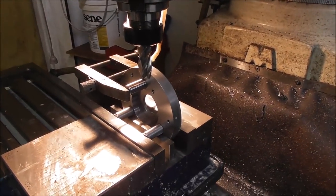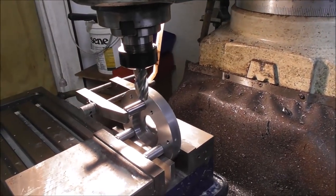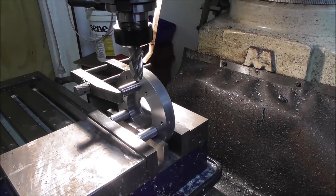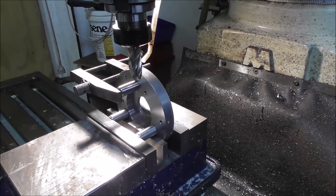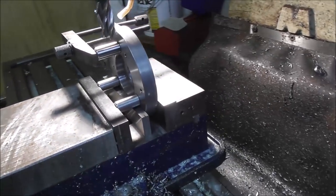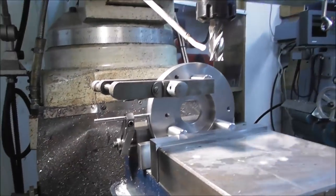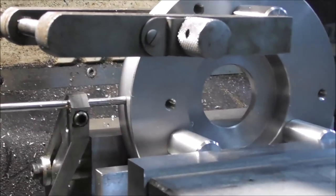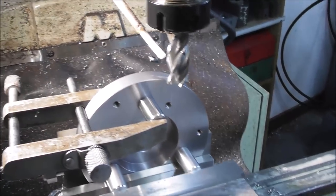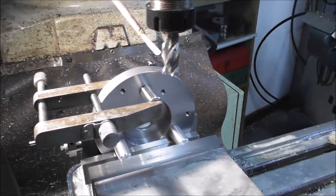I'm sure there are lots of different ways that you could machine the Camlock scallop out of the studs. This is just one way. You could do it on a CNC mill with a little bit of code, but I'm just quickly doing it on a manual mill here, putting it down two of the studs on a parallel, referencing it lengthwise off a stop here, and tightening the studs on really firmly in the vise, and then just putting a safety backup of a toolmaker's clamp. Probably isn't needed, but still.